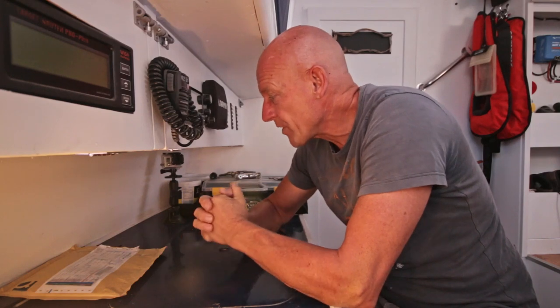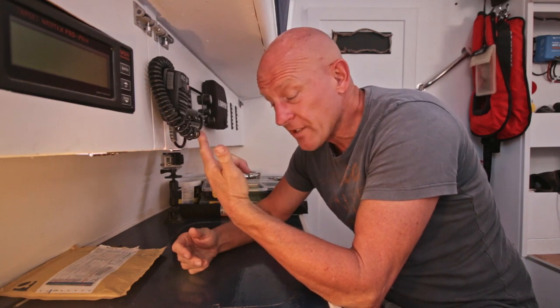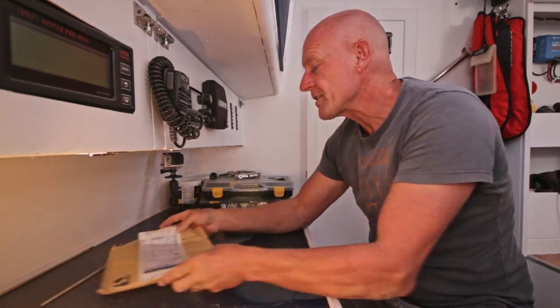So as I said, the water maker needs a rebuild. I need to renew all the seals. I look what's inside, if there's gunk or whatever in it that prevents the water maker from working, because it doesn't do anything. The pressure gauge doesn't work, the water maker doesn't work, you don't hear the switching inside the Clark pump. So enough work, I guess.